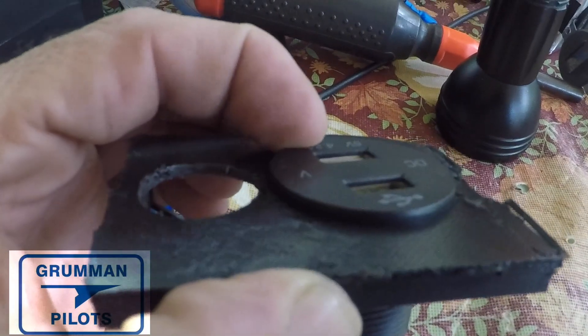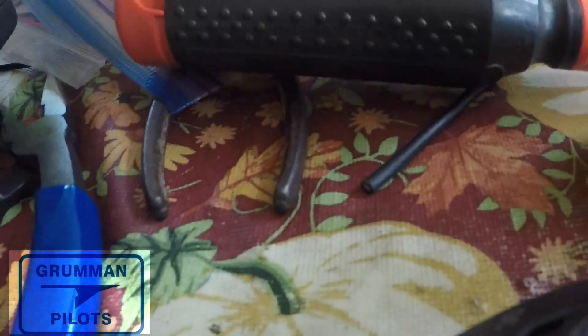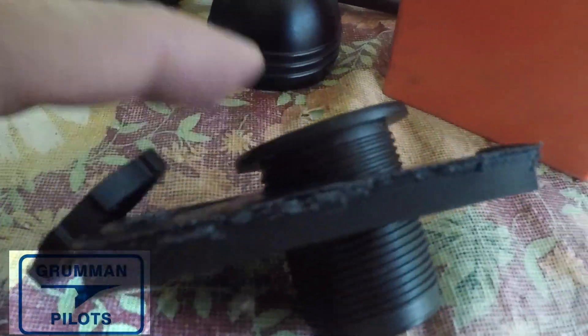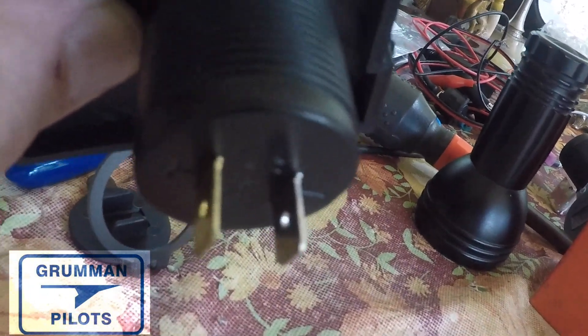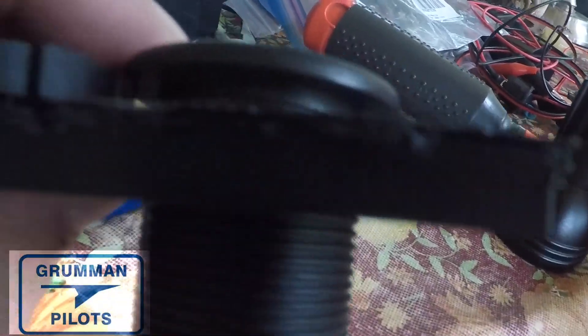Here's what it looks like in profile — you can see how deep it sits in there. Looking into the battery we notice there's a hump at the bottom, which creates a clearance issue. I'm thinking we'll put some sort of a quarter-inch-thick shim underneath it so you get a little more profile and more clearance at the bottom. We'll have to solder to those tabs and heat-shrink them, but a quarter-inch raise should give us plenty of room.